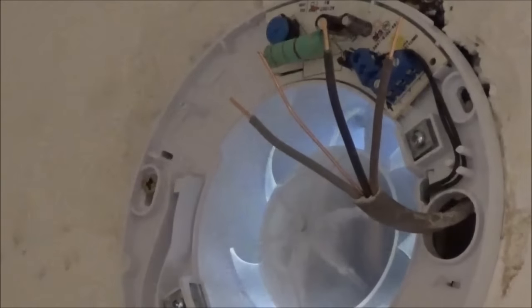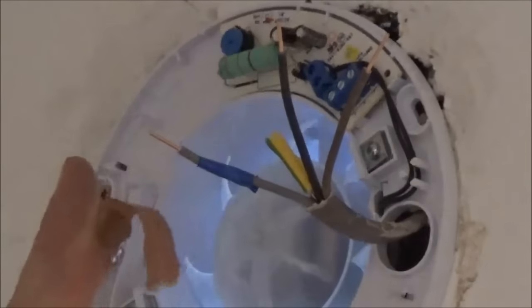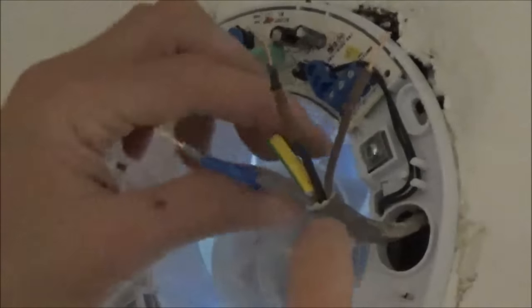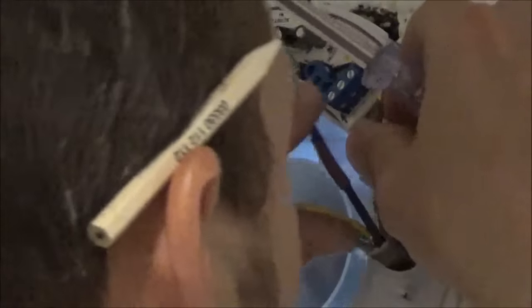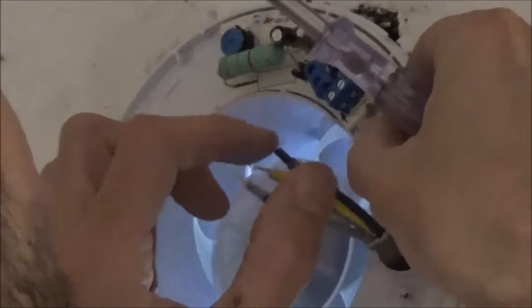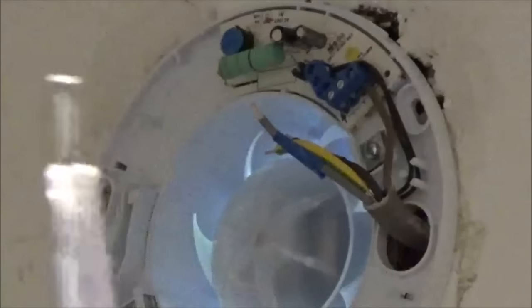On this installation there's no requirement for an earth on the extractor fan because it's plastic, so I'm putting the earth sheath over it and folding it back out of the way. Putting a little bit of blue tape around the grey cable (the neutral) and brown tape around any switch live. I have earth continuity all the way to my isolation switch, so if this ever needed to be earthed it would work. Push the cable back through the conduit to conceal the grey sheath. I'll take a little bit of copper off the tops of the conductors as they're a little long for the connector block. You will need an electrical screwdriver with a very fine tip, as some of these small connections won't physically fit a standard screwdriver head.